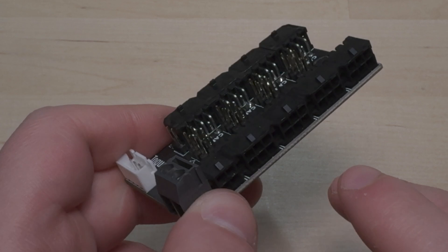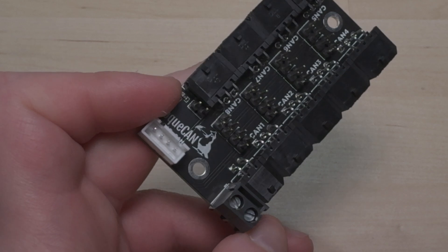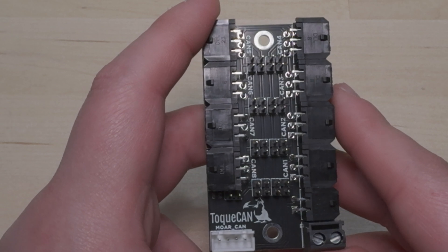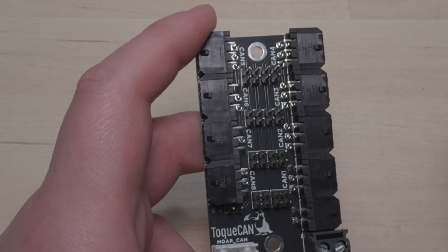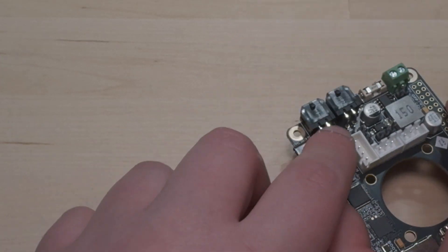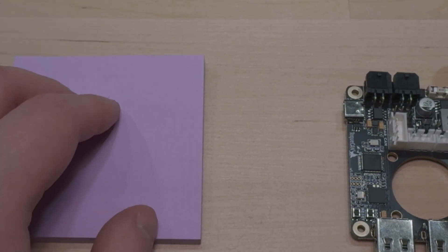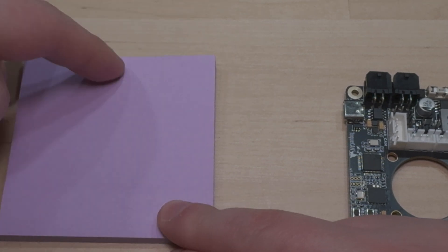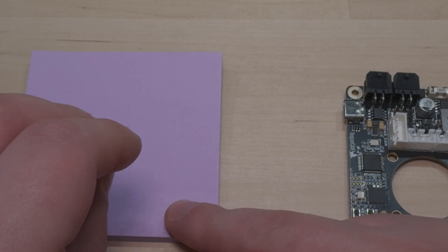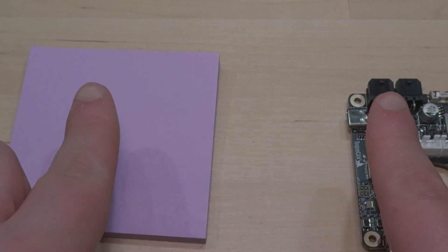Let's talk about why there are six-pin CAN connectors here and on the Burst Nest CAN. In a typical CAN hub — or if you're using WAgos to join CAN lines together — you have your CAN adapter with wires running to the hub, and all the high and low lines joined there and running to your various tool heads. This is similar to a star topology, and the reason you don't want to do that with CAN is because CAN is not designed to be wired that way. CAN is designed to be on a linear bus, not following star topology.